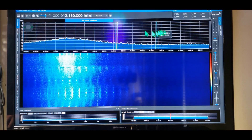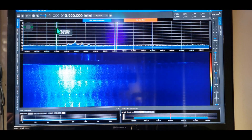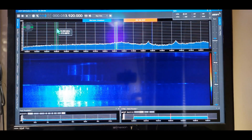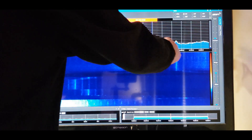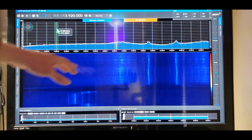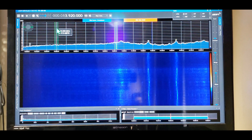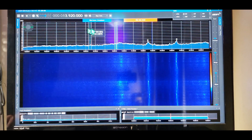We're up now pretty close to 17 to 20 meters. There's 20 meters — let's see if we've got any resonance. Trying to bring the capacitance in... there's a little something, but okay — that's the back side of the capacitor. When you see it come away and come together like that, that means we're not resonating. I'm having a hard time hitting 20 meters with this loop.